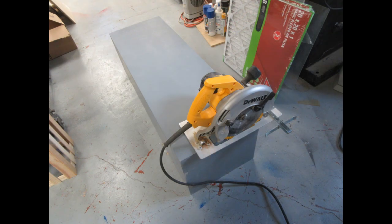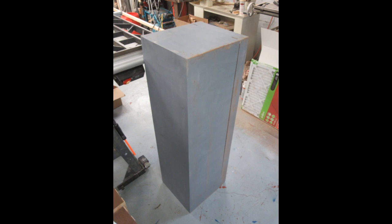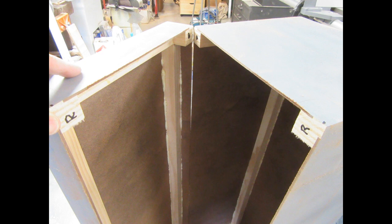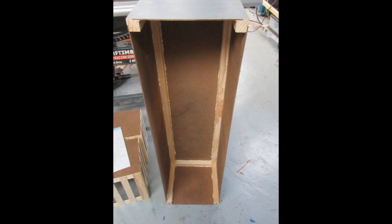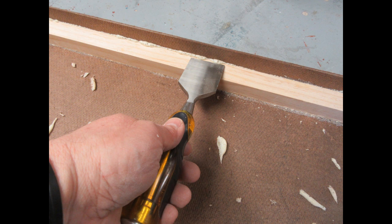Now I get my circular saw out and cut the case between its lid and the body. I use the circular saw for these bigger cases because I can't get the case up on the table saw, which I'd normally use otherwise. Here's with the lid swung open from the body of the case, and I've made a couple of registration marks so I can always make sure I know the orientation of the lid to the body because it fits best that way. This is the first time I've seen the inside of the case since I Gorilla Glued the panels onto the frame. Because the glue foams out before hardening, I use a chisel at this point to quickly clear off the excess glue because it gets in the way of some other steps.